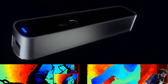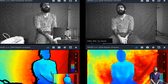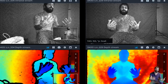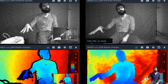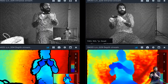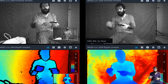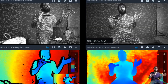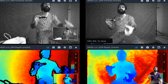Structure Core is available in a compact and beautiful package. That's amazing. They haven't released the new SDK yet — I contacted Occipital yesterday because I downloaded the old Structure SDK. I'll have to dive into it over the next few days to get it functional. You can see that the applications for both sensors are similar, but this one goes down to about 30 or 40 centimeters for the Occipital Core, whereas the Intel system is about 0.2 meters. The Intel has a 90-degree field of view; the Occipital Core has a 160-degree field of view for visible light but about 85 degrees for the RGB sensor.